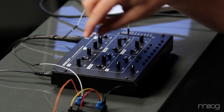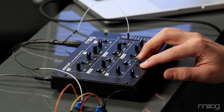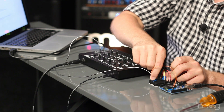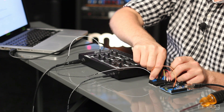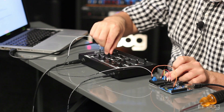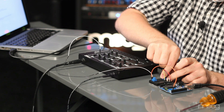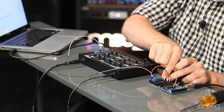This noise circuit works best with the pulse wave setting in your VCO. I'm going to turn the VCA to the on position so we can hear the difference in color as I turn the color potentiometer. You can hear as I turn this potentiometer the color of the noise change. And as I turn the other one, you'll hear the mix change.